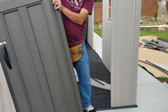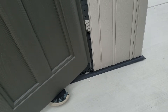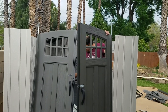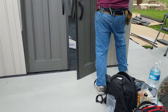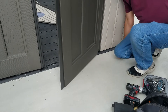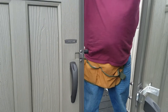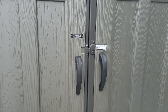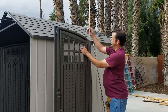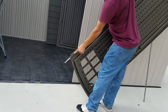You insert the right-hand door tube — the long one, because these are your side doors — the same fashion as the first one, with that little indentation towards the front and the plastic piece that it pops down into, that little hole facing towards the front as well. Give it a couple of taps until you feel it's down. Then you come around the front, and if everything is lined up perfectly — it takes a few minutes to line it all up in the beginning, but it makes all the difference in the world. See how quick and easy that cotter pin just slides right through there. The concrete being nice and level is the best way to go with the larger size ones; the flatter foundation you have, the easier it is to build these. Then I swing the right-hand door in and put my arm through the hole in the window, because I always put the windows on last just for that reason. I lock that deadbolt. So that should be okay on those doors, and then I usually put the gable on right after that.